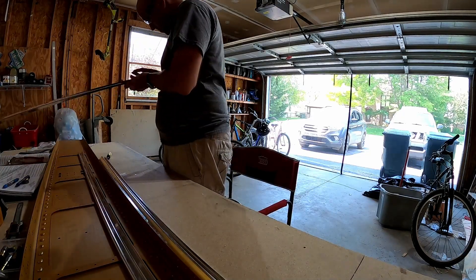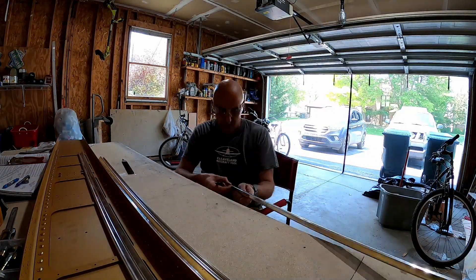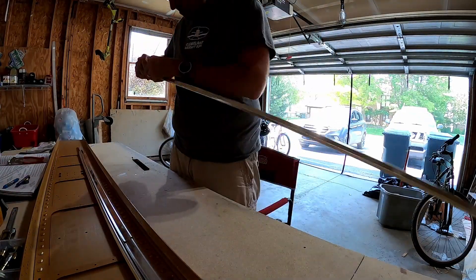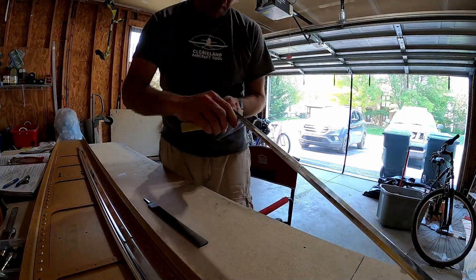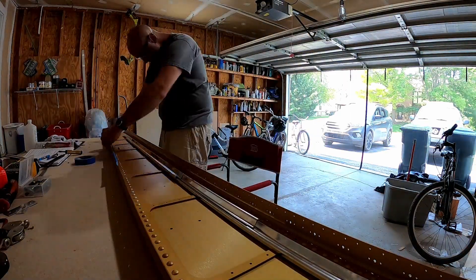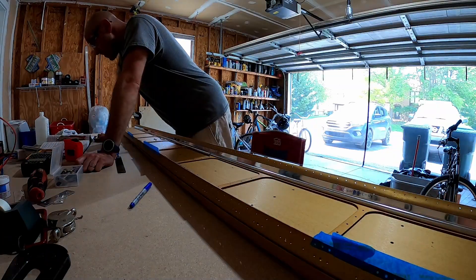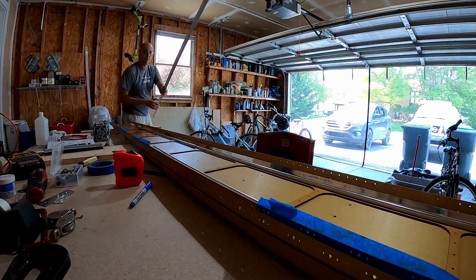In the next video, you'll actually clamp these to the spar and use the spar as a drill guide. I was very nervous about that because it's this beautiful piece of anodized aluminum that's been carefully riveted together and covered with a nice coating to protect it from corrosion — and the first thing I'm going to do is drill into it. There are also additional pieces where they say don't drill these out when you use the bottom as a guide, so I had to tape over those so I don't make a mistake that a lot of people make.